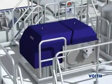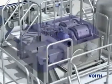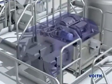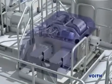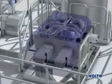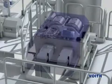The Duo Shake is in operation worldwide and has repeatedly proven its impact and superiority in mills. Duo Shake equipped machines cover the entire range of low- to high-speed paper machines of up to 1,200 meters per minute and basis weights from 18 to 550 grams per square meter.